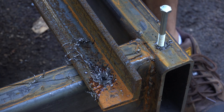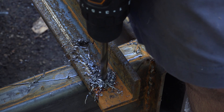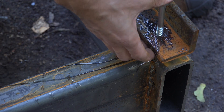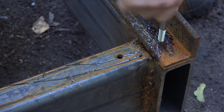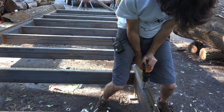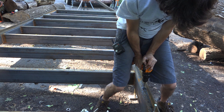I'm going to use this first bolt hole to keep the track in position as I drill the rest of the holes. In order to do that, I'm just going to enlarge the hole in the track to three eighths of an inch to hold it in position. And then when I'm done drilling all the holes, I'm going to come back and enlarge this a bit further. I'm going to add one hole at every intersection of the cross members and then one in between.